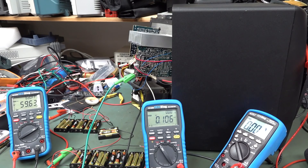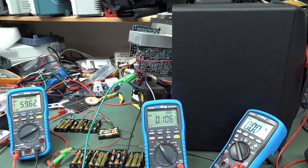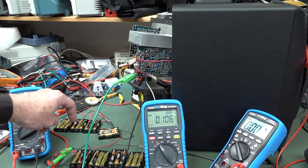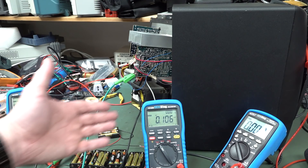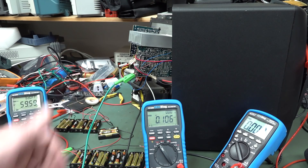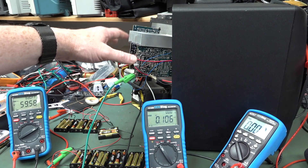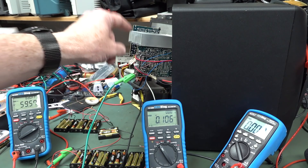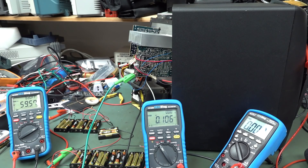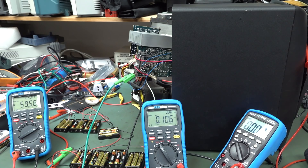That's an interesting result — we were able to get the noise down using a DC battery supply. It's running at about 17 volts under load rather than 19.5V, but that doesn't explain the drastic drop in noise. Even with the input shorted — dismissing ground loop theories — there is noise inherent within the amplifier chip. It's just inherent in the topology, but interestingly we were able to lower it, even though I can still hear it.